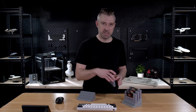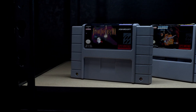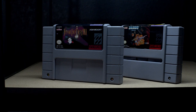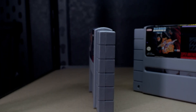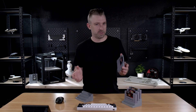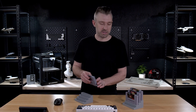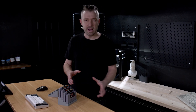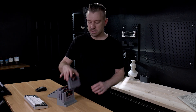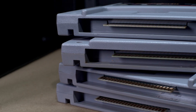If you look at these cartridges, you'll see that these aren't a single-piece design. These are actually two different injection-molded pieces held together by screws. What this means is we can't simply measure this and trust that that's going to be the width of the product that we are trying to make a dock for. Because every single one of these cartridges is more likely to be a different thickness, and we need to find an average that's not too loose but not too tight for the stand. And some of these cartridges are straight across the bottom while others have a slight bow or curve from manufacturing.